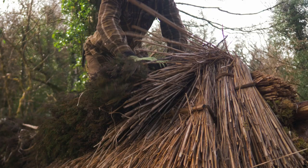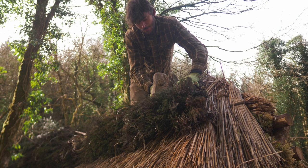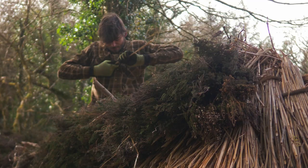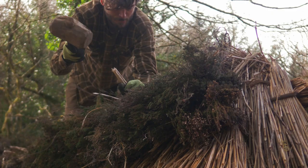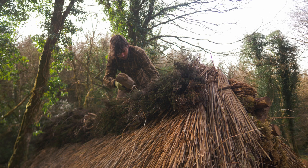In the first part of this thatching project, we started with laying the ridge roll. That roll is laying underneath here and is now very important, forming a basis for the scallops to tightly grip into. And so the ridge thatch can be heavily compacted and stays in place.